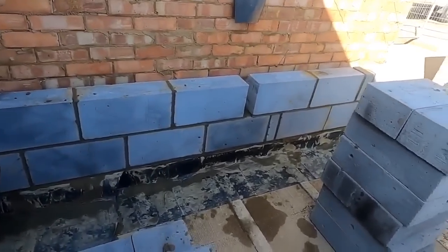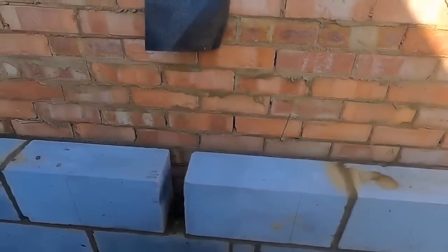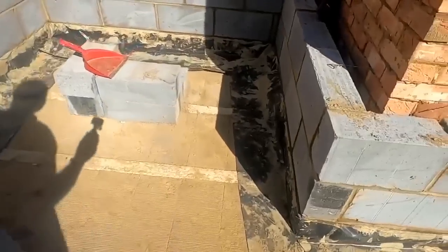Yeah, you get these funny cuts, a little cut under the frame, but you've got to do that. For the lintels, you can't have the little cut on the end. That's what happens with 140s. It's not the same as 4-inch blocks, 100mm blocks. It works a bit different. No, that has to be a 3/4 to give you half bond.